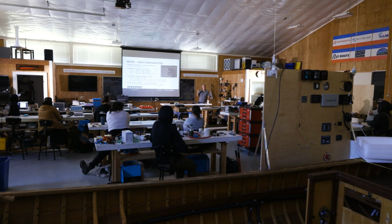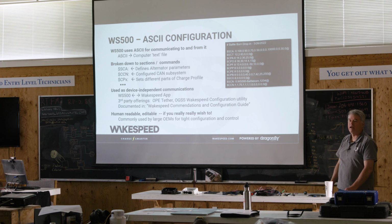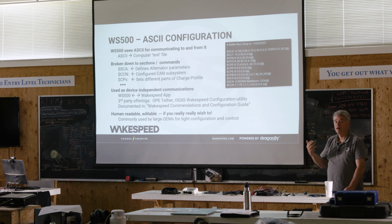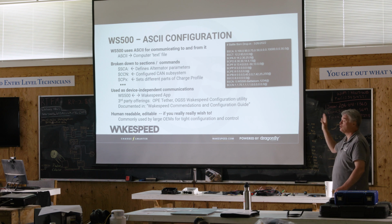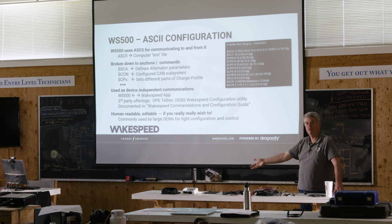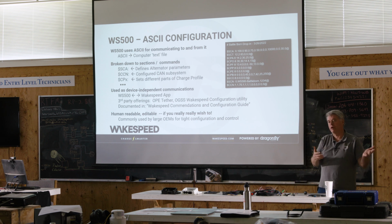Like a 9999 C rate? It won't just, yeah, set my batteries on fire. Exactly. There are limits to that, but it's not absolute. Really, you gotta be careful with this stuff. You gotta be careful you don't mess it up. Typically, if you provide a short string, the regulator will accept it, because when we add new parameters, we put them on the end. You may have dropped the parameter in the middle and everything shifted over. It's fiddly. You have to be very, very careful when you do this.